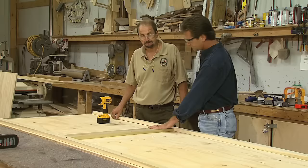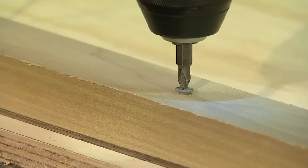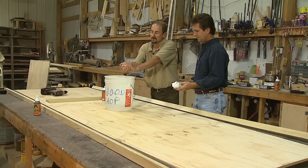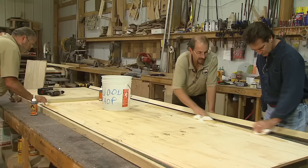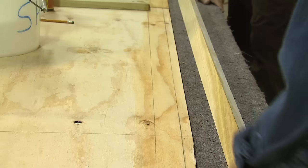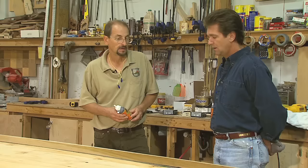Obviously we've got to get it ready for gluing. Our rails are set and we're marked. Now we're going to take these off — we're going to leave the cleat in place so we've got a bonding agent between the two pieces of plywood. We're going to pull the rails off and clean them. We've got wet cloths — we want to get enough water on it to dampen it real good. That cleans the dust off and gives us a tracing agent for the glue to bond into. Soak it in pretty good everywhere inside that line — it doesn't have to be dripping wet, just damp so when you leave it and look back, it's still damp.